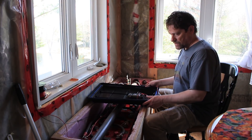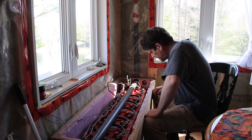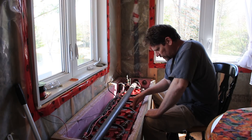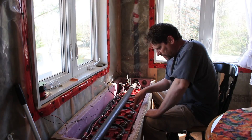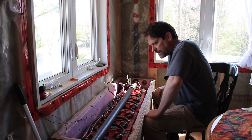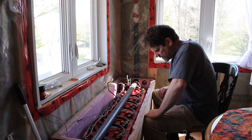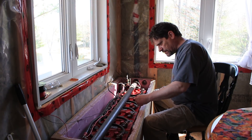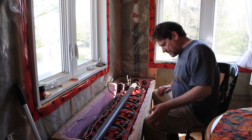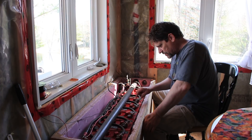I was sitting here looking at my batteries thinking, what the heck do I do next? How do I troubleshoot this? And I noticed this connection right here was loose. This bolt on this battery was loose. How could that be? That's one thing you do — you tighten all the battery connections pretty snug. But this one looked like it had just been finger-tightened. So I put my fingers on it to see if I could tighten it anymore, and that's when I realized it was very hot.